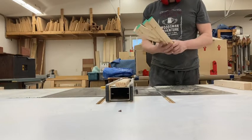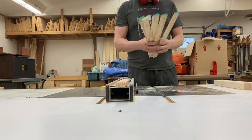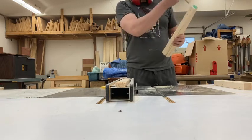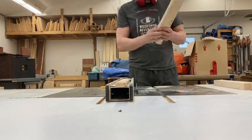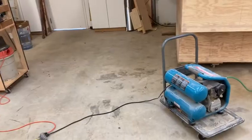I just ripped some pieces for the front window and the front of the bed area, and also ripping some extra stock — a couple more things — to go in between the rafters just for some support when I put the ceiling paneling on. I'll continue to do that, and then we're going to make a front window. One thing I want to do before I forget: I've got to strike a couple lines and just staple from the outside the small window framing we just put in, so I'm going to do that now.